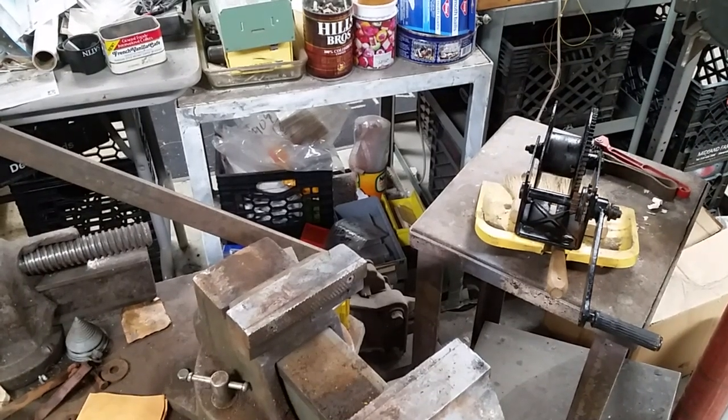A lot of behind-the-scenes effort at this point. One of the shafts on those jacks I actually had to put in the lathe and make a custom high-speed steel tool to clean out the threads so that it actually worked — it had so much rust built up in it. The other one I had to rebuild by going to the local junkyard and getting another one; between the two I was able to make one good one. So that's where we are as of today — I'm waiting for the fuel pump and a little bit cooler weather. Maybe I'll work an hour or two in the mornings.